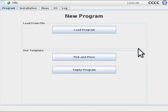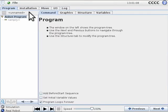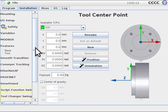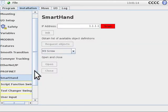After restart, select program robot. Start an empty program, navigate to the installation tab and scroll down to the entry Smart Hand. If your Smart Hand is on the same subnet as the robot, press scan to search for the Smart Hand. The button turns orange once the hand has been found. Press init to launch the hand's URCap server. Once the scan button turns green, you can use the open and close buttons to test your gripper.